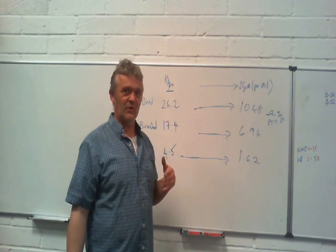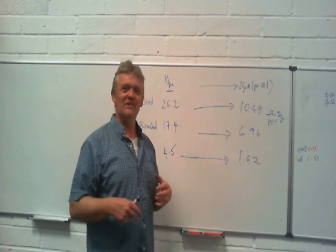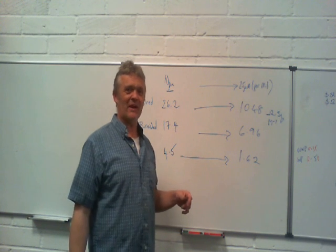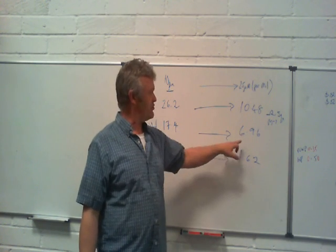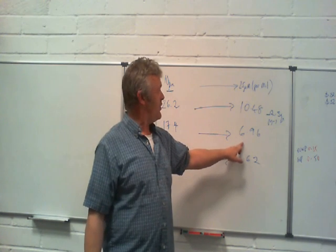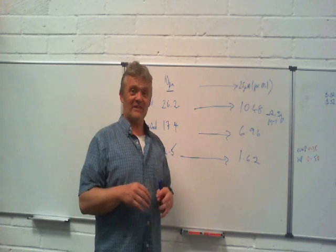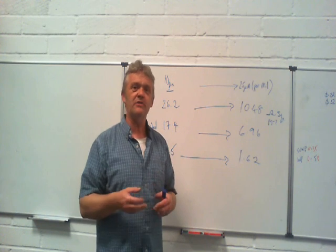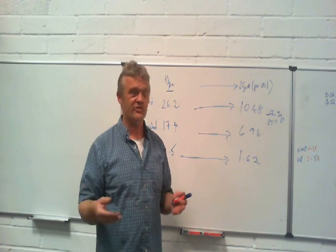If you want to anneal it and you do it at home with a spoon, you're going to get 1.62. If you do it with steel rollers, I've got no idea what it would be if you put a bit of actual pressure on there rather than rubbing it with the back of a plastic spoon. If you can't do that or it's on a surface where you can't, then if you just rub it with a soft cloth it'll turn out to be the same resistivity as our conductive ink. If you don't do anything at all, you'll get about 10.5 ohms per square per mil, which is really quite good for an ink you just apply with a brush or a pen. It's much more liquid, so it can be applied with a pen, and my plan is to put it into a pen so that we can draw circuits at this kind of resistivity.